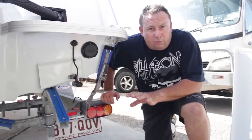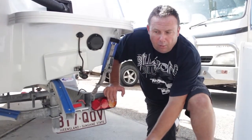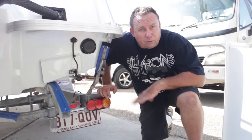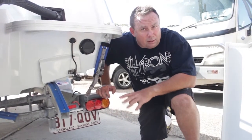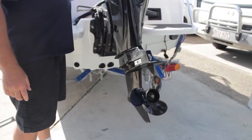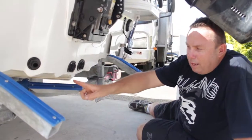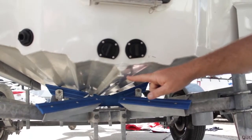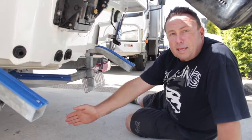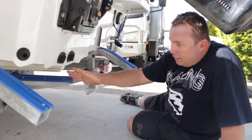The vessel's draft is measured from the waterline down to the lowest point. Working from the chine, I'd give that approximately half a metre. On average, an outboard has about half a metre of draft — measured to the lowest point whether it's the hull, the propeller, or another reference point on a yacht like the keel. Here we have the keel — it's the bottom of a vessel's hull structure located along the centre line. On a yacht you'd have that great big thing that hangs down; its true job is to be a counterweight to stop the pressure of the wind rolling the boat over. On this boat it's only a one-inch keel — nice and easy, slicks through the water.